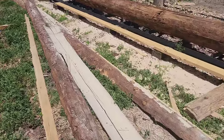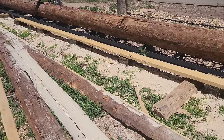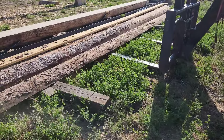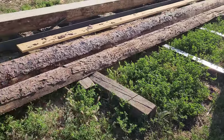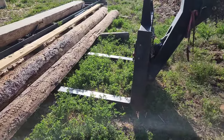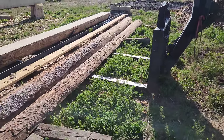I think if I put some bigger stickers there, and maybe three of them instead of two, or even four, that should help — be a lot simpler. The idea is we can just fork them right up with the telly. So now we put these 6x6 blocks here so it spaces it off the ground more, and as you can see when the slabs are laid over, they're spaced off the ground enough that the forks from the telehandler can very easily slip under.